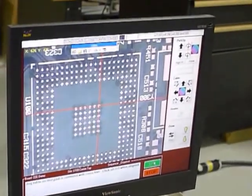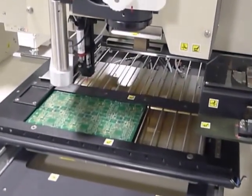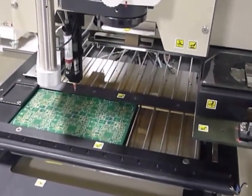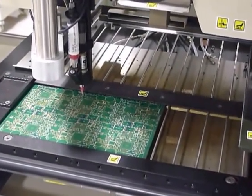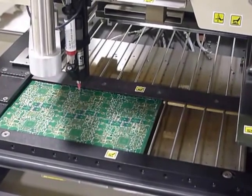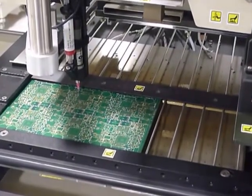And then confirm the other end pad. It does a board height detection sequence — it checks three spots around the component to make sure it has the height set correctly. What you're seeing dispensed right now is just purge compound in the valve — basically pink vaseline.